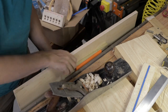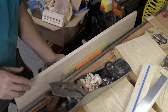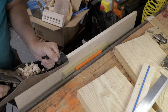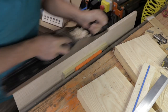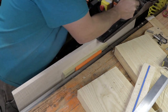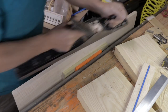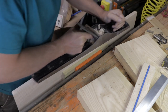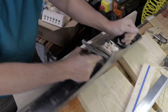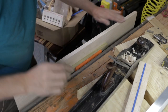It's cutting well, but this is figured wood so I need to back off the iron a bit. We're rubbing the cat the wrong way - let's try planing in the other direction. With figured wood, it's hyper important which direction you're planing. Going this way is going to be much better - you can hear the difference. Now we've got two jointed edges, so that should go through our router table.